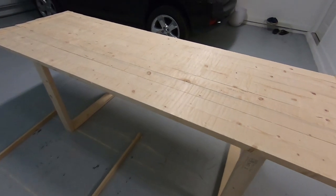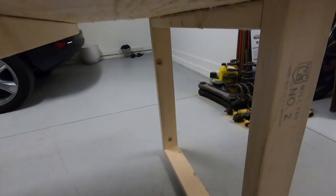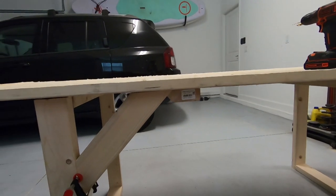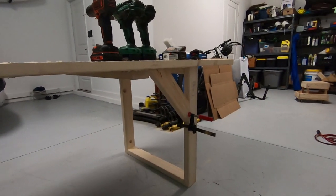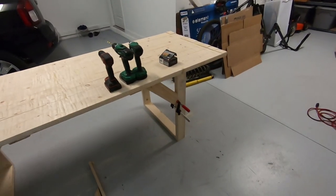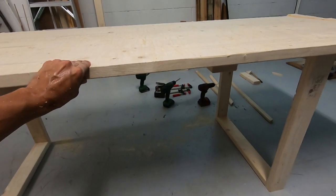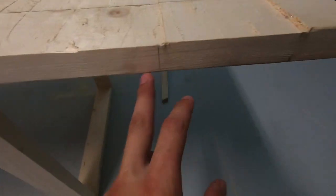So what I'm planning, I kind of figured this would happen. I'm gonna cut a 45 to go from here to here. I cut 2 45s that'll fit between the support and this rear leg. We're gonna screw these in and see how much it helps with stability. Go from there. All right, I don't know how easy you'll be able to tell, but it's a million times stabler now.